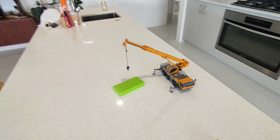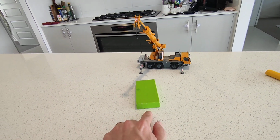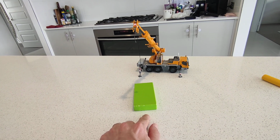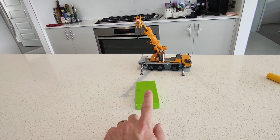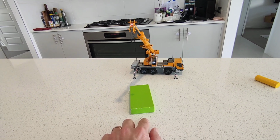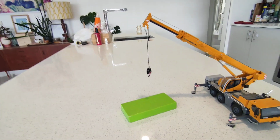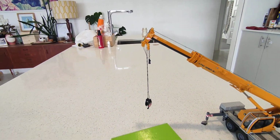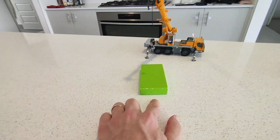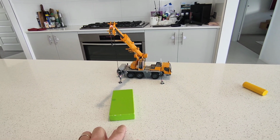And what happens is, some riggers will go over here and say, well, 9 times out of 10 I've stood in the center of the load and I've picked it and it's been perfect. But that's not the case at all. Now you're pretty much picking the guy's slew. You're not actually picking the jib. Alright? And so if you look back here, you should be 90 degrees from the boom tip. You shouldn't be center of the load, because center of the load will put you over here, bruv. And most of the time it's out.